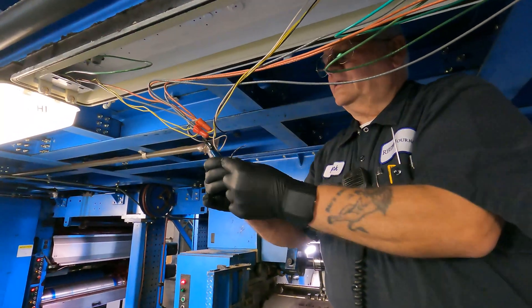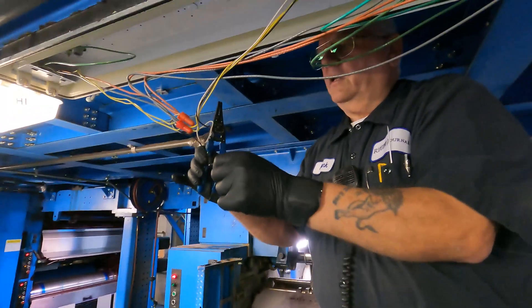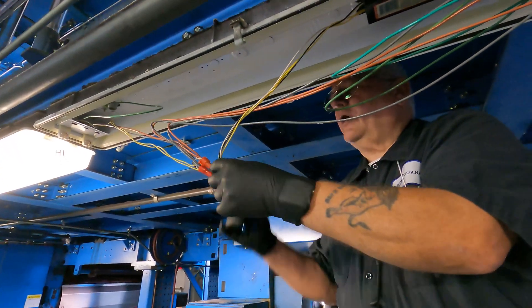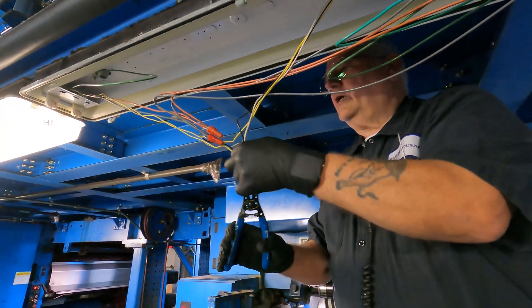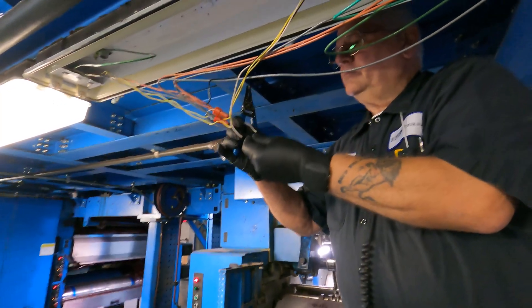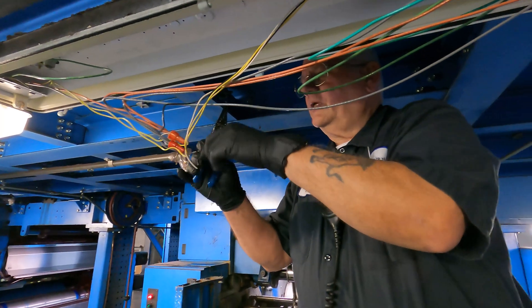So now it's done. But that tip is alive, so first thing I do is I cap it — cap it while I'm doing all my work. I'm gonna do the same thing with the white one. Once I cut the white one, there's no more voltage anywhere except for on these caps. Everything else I'm working on now is gonna be a dead circuit.